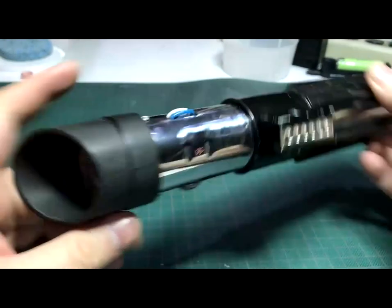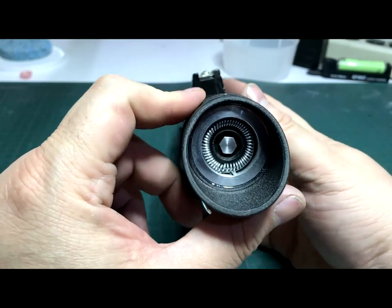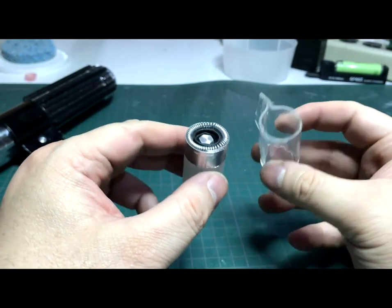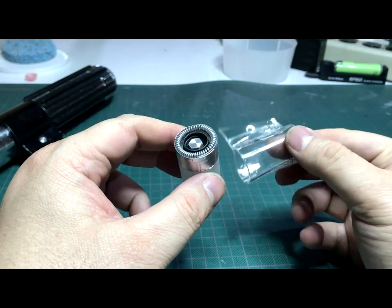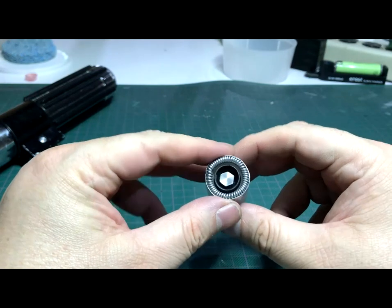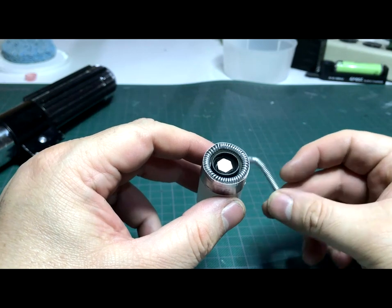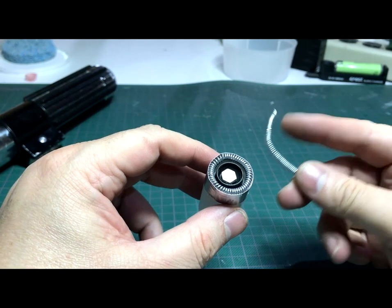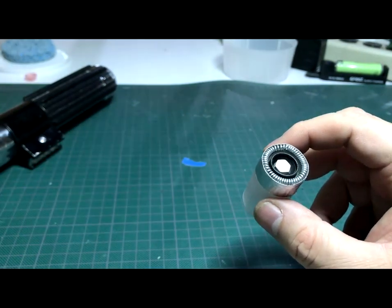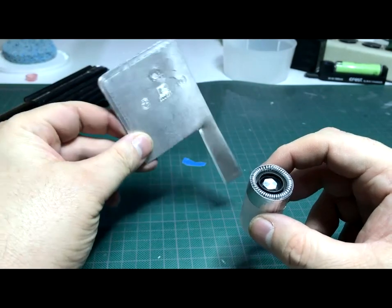And finally the blade plug. I had no materials to do a proper blade plug, and I was very anxious to get one. So I got some acrylic, I heated it up, and I made my own tube. Then I made my own coil with some thin wire. I coiled it up around a thin drill bit on my power screwdriver and routed it into shape. And then for the hex nut, I made it from an aluminum plate outlet cover. I simply cut and filed to size.